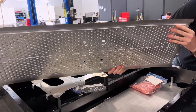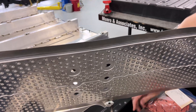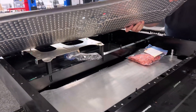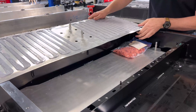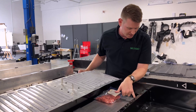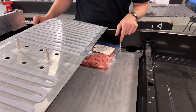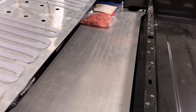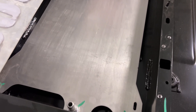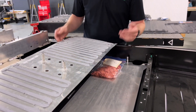You can see a little bit of the overhang from the brazing operation. On the Lightning, this material was removed from the overall assembly, which is a big weight save. Not necessarily a material save, given that these pickup provisions kick out and the blank size overall doesn't change — but this is all off-fall, can be recycled, sent back to suppliers, and sold as scrap. Between the Mach-E launching and the Lightning coming out, this small and relatively easy change is a good one in the right direction.